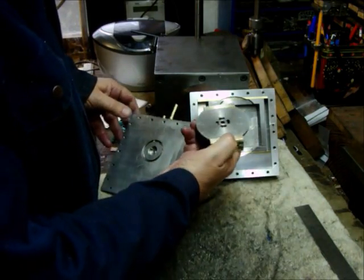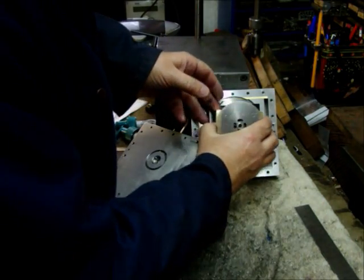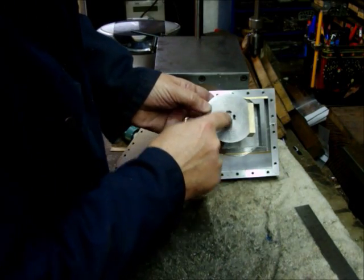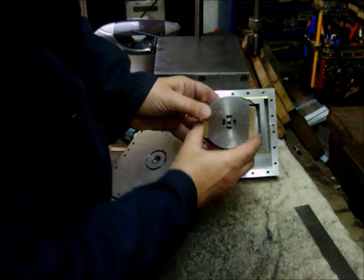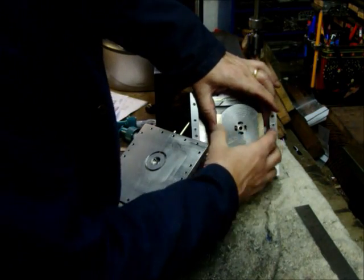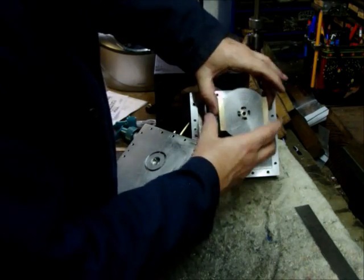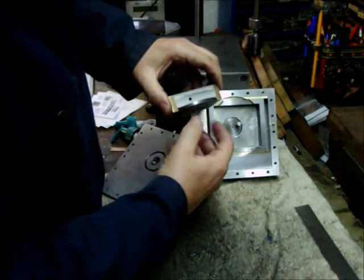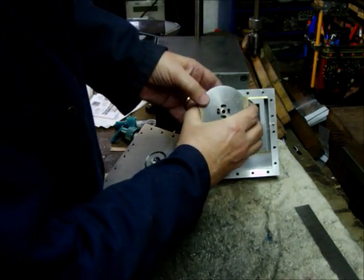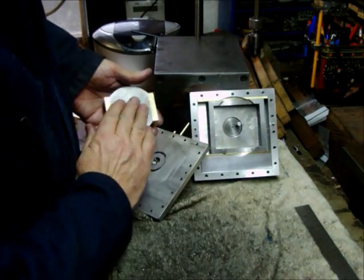For vertical movement, if it's going that way, the air goes in these two ports or exits up into the top. If it's going to the top it pushes it down; the air going to the bottom pushes it up. These flanges here are slightly pressurised on the cylinder, and it pushes it onto the port face to seal it there.